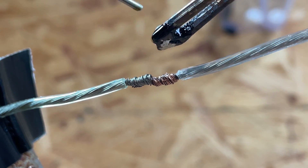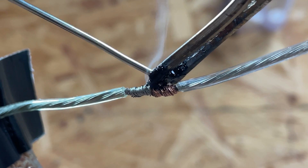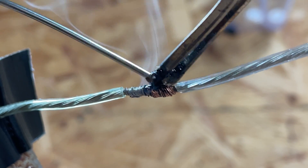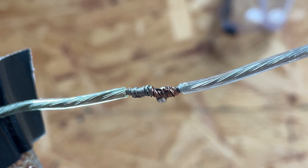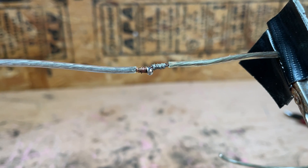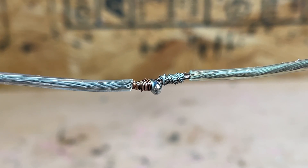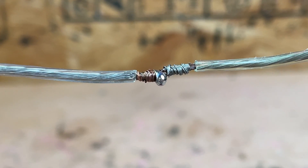I've activated my soldering iron — it's heating up and this thing gets hot quick. Now I'm going to try to just melt solder onto the tip of the iron. It's not wanting to go onto the joint because the joint isn't hot. I just dripped a big old chunk onto my desk here. I flipped it around and you can see there's just a big ball of solder hanging off the back — this is exactly what you do not want. The solder is just sitting on top, which literally does nothing. I could probably pick that piece of solder right off with my fingernail.